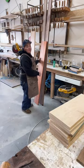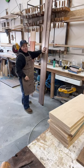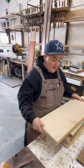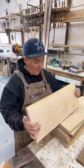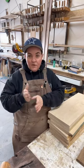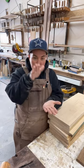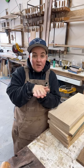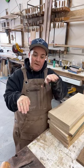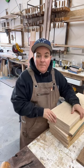So I'm gonna glue together these two pieces of walnut that are the same thickness as that maple. And we're gonna make some cool things out of it. It's gonna be drunken cutting boards. And the most important thing about making anything curvy with wood is that you cut however you're gonna make it curvy, you place your pieces on top securely and cut them together. That way they perfectly fit together when you swap out your pieces like maple, walnut, things like that.